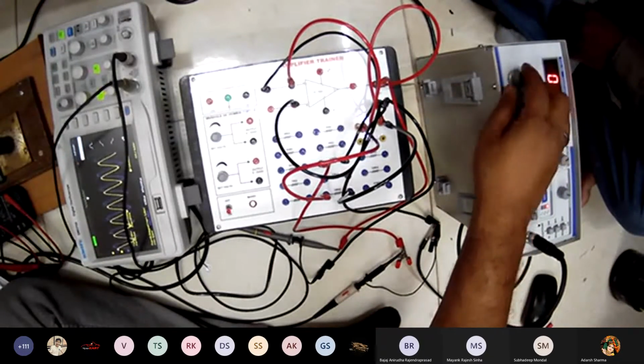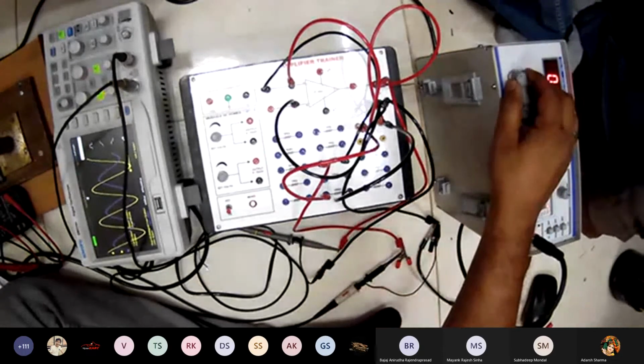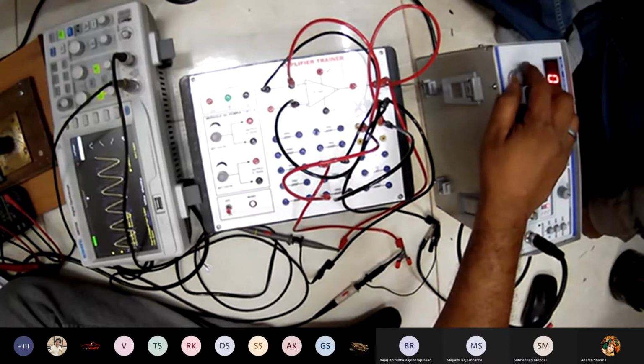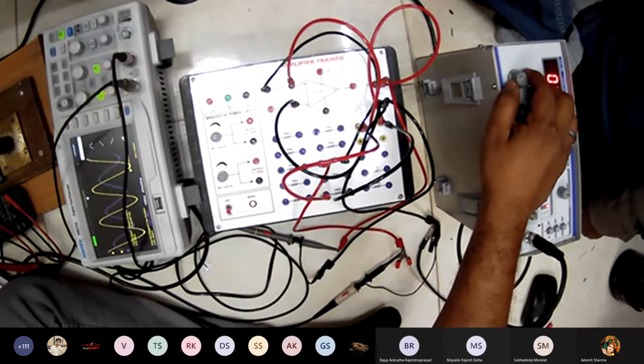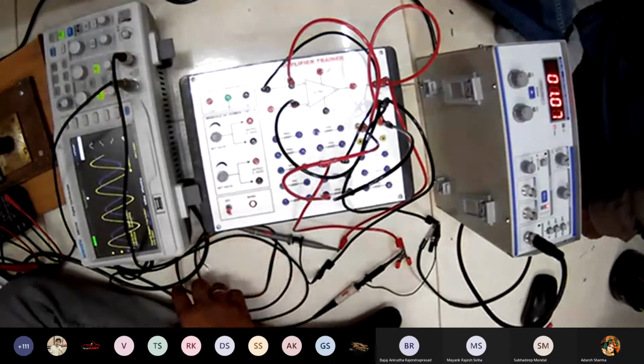The amplification and attenuation also depend on the frequency. So as I'm shifting the frequency, you will see how the output wave, which is the yellow trace, changes in amplitude as well. All these different aspects you will either see in the assignment, and of course you'll always learn it in the basic AC course. Such kinds of circuits are used as active filters as well.